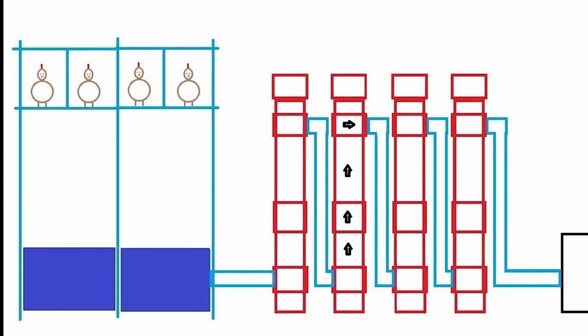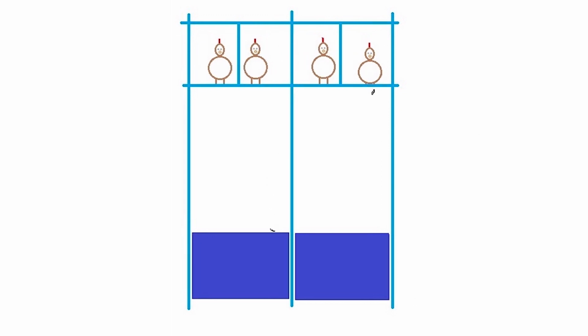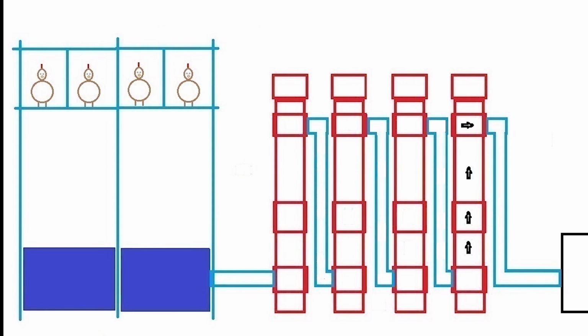The chicken aquaponics processing system is comprised of two major components: the waste capturing station and the biological reactor. The waste capturing station houses overnight hens in a coop suspended over two 200-liter catchments filled with water. The catchments have pumps that are designed to break down the waste into small particulate matter. The wastewater is pumped into the second major component of the system, the biological reactor.